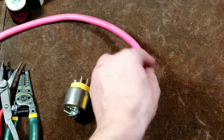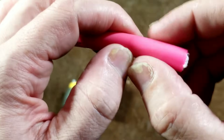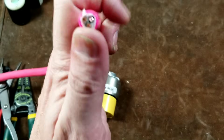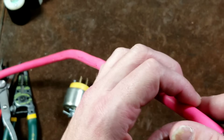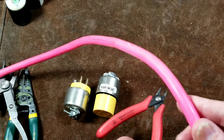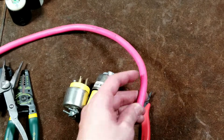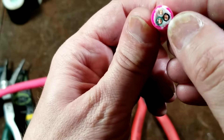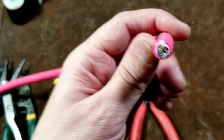The aspects I wanted to cover: a lot of people use a utility knife to cut the outer insulation, but I've always had hit and miss because oftentimes I end up nicking the insulation on the inner wires. So this time I'm actually going to use a small pair of cutters to cut it away — it's the longer process, but unless you're replacing cord ends for a living, it's not a big deal. The second thing a lot of people do is they don't always cut away the cord packing, which is what you're supposed to do.